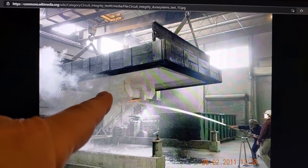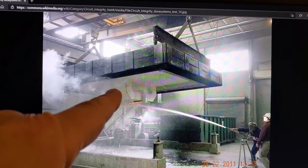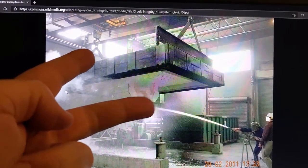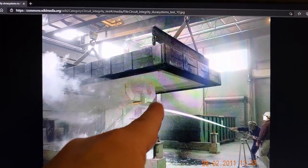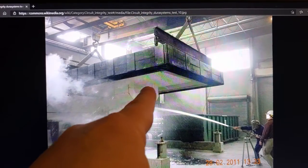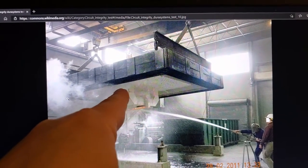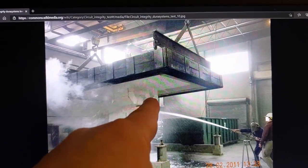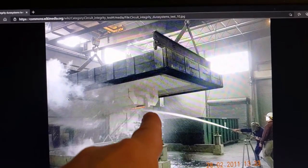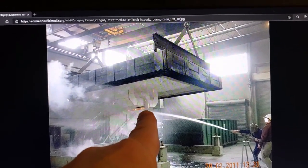The intent of the code for pressurization ductwork, it mentions ASTM E119. So if it passes the conditions of acceptance, fire can't get through, heat can't get through, hose stream can't get through, for the whole thing, not just the fire stop. See, for the ducting, they only instrument the unexposed side, and they hose the fire stop portion of it. Well, what about this, right? In the electrical fireproofing, you can't blow through to the inside, right? And that's the level of protection that is given in ASTM E119, which is code intent.